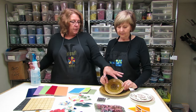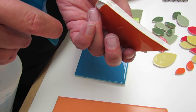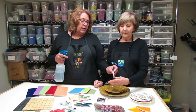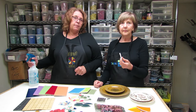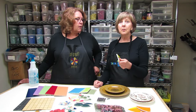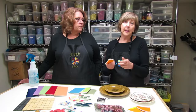Here we have some plates and a broken vase, and you can do the same thing with all these materials — a little spritz of water on the edge. If it disappears and soaks in quickly, it's porous and can't be used outside. It's all about the clay body and whether the ceramic was fired to vitrification — if it was fired high enough that it can go outside.